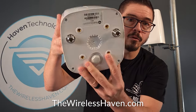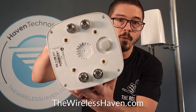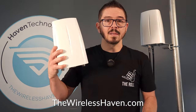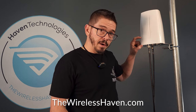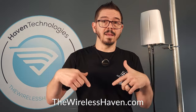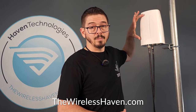You'll see that the N-type connectors, the way they're spaced, as well as the mounting points — this is for the 2x2 MIMO — and the 4x4 MIMO with the four different N-type connectors. To give you a relatively good idea of how big this is, it's not huge but it's not very small either. It's a very good size for an omnidirectional antenna. Some of the other omnidirectional antennas that are 4x4 are very, very small, and that works okay for just being up in the air or outside of an RV and helps get your signal much better than the antenna being inside. But in general, larger elements work much better and are allowed to have a much better dBi rating due to the antenna element size for an omnidirectional.